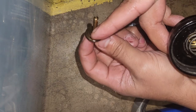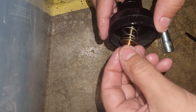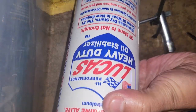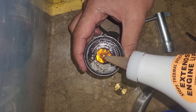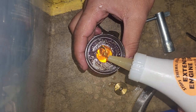You're going to want to line up the big hole — there's a little hole right here as well, but don't worry about that one, you're worried about the big hole. Line up the big hole with the other bent end of the spring, then push that in. Once you've got it pushed in, you're going to insert the grenade pin into it, then turn it so it's all the way at the very top so that you can pour the oil into it. Take your Lucas heavy duty oil stabilizer and pour it in there until it fills up. This stuff is super thick — it's like molasses — but that's good because that viscosity is what provides the resistance needed for the timer to work.